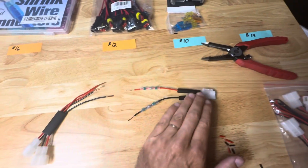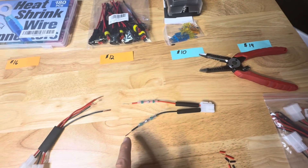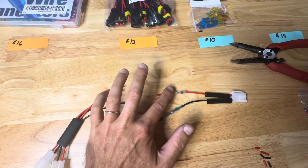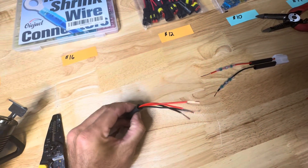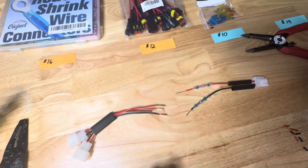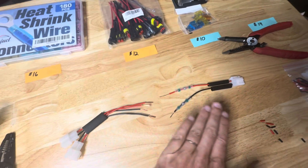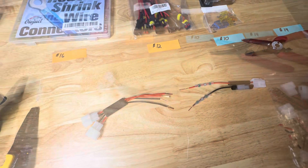Before we wire it all together, because the ends are already on it, it's important to remember — if you are going to use shrink tube, put the shrink tube on first. I've put two versions of shrink tube on this side and some heat shrink solderless connectors on this side. On the other side, I put one bigger piece of shrink tube over everything, and we're going to pull that back over and shrink it down on top of the connections once it's done. Before you twist everything together, you can't get your tube on afterwards, so set things up prepared.